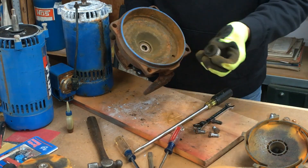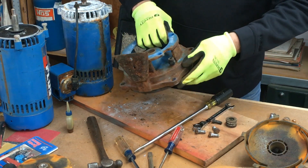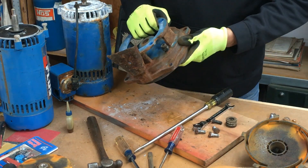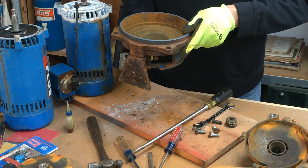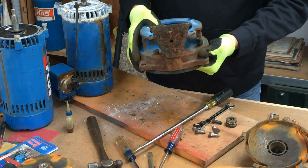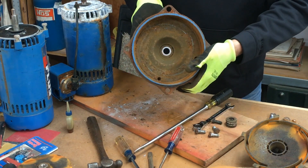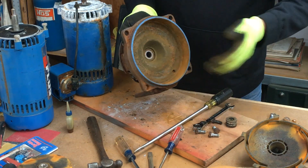You're going to break it — it won't be usable again, so you'll have to get a new one, which you'll be getting anyway. The motor adapter itself has a drain plug and a plastic fitting for the tubing going to the pressure switch. This can be cleaned up — just surface rust. Clean it up, paint it if you want, as long as it's not cracked anywhere it's totally reusable. They don't break unless they freeze; if they freeze they'll crack and leak water.